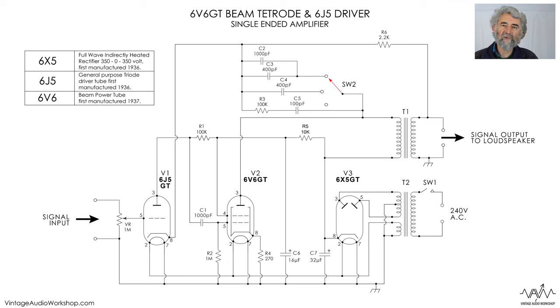The next stage seems very keen on the precise value of 1400 pF, because we've got the 400 and the 1000 pF. One would have thought they could have used the nearest preferred value of 1500 pF. But if you switch to that position, even more treble is fed back, giving more treble cut. So the positions are: normal, a bit cut, very cut.